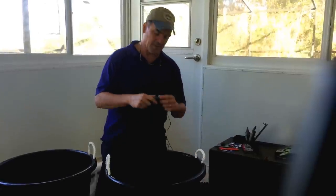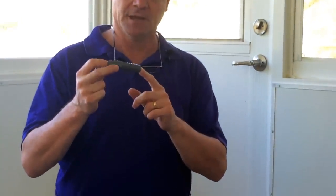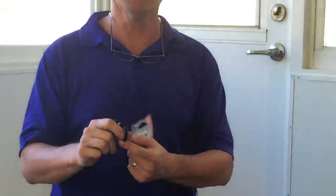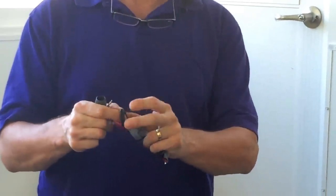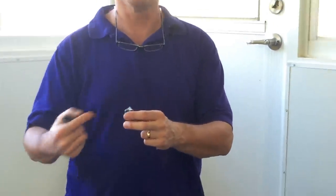We're going to need a 3/4-inch barbed coupler, which we picked up at our local hardware store. We also have 3/4-inch grommets — we found a three-pack at the local hardware store. These are split-ring grommets where one side goes on the inner wall and the other side goes on the outer wall, and that's what our drain line will go through when using this barbed connector.